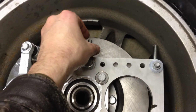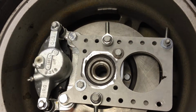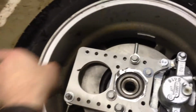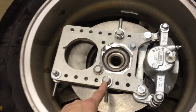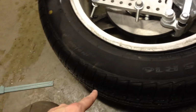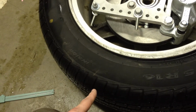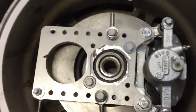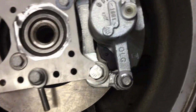These provide our caster angle, and in fact they are upside down. We're looking at this upside down. Okay, now this is the front of the car, and now we have the correct caster angle. So the line between these coming out the bottom of the car, the gap between the center contact patch and the kingpin point, as it's called, is what gives us our caster, the ability for the steering to recenter exiting a turn. As we can see, this all fits inside the standard RSX wheel, and now what we need to do is find out by how much.